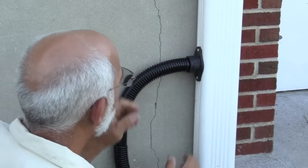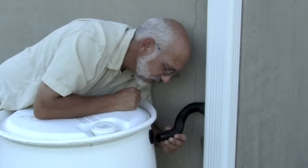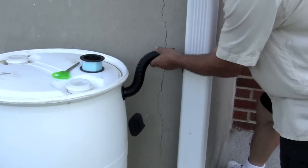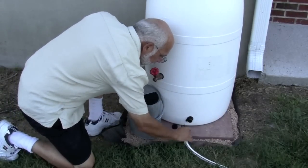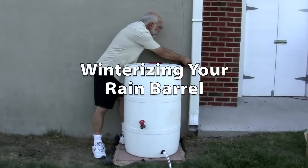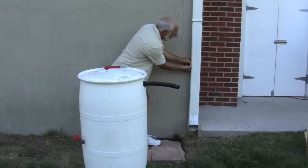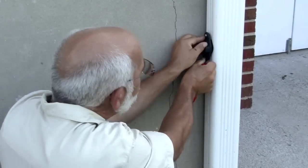Connect the fill hose to the diverter. If you need to shorten the fill hose, cut it at one of the flat sections. Connect the other end of the fill hose to the water inlet fitting on the barrel. You can use a piece of fishing line to make sure you don't lose your winter hole cover. Now you're ready to harvest the rain — be sure to close your front drain fittings so your rainwater doesn't run out. Don't let water freeze in your rain barrel; disconnect your barrel and drain it completely, then attach the winter hole cover with two screws.